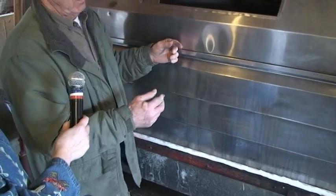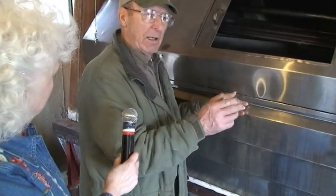And then this part of the evaporator, the way I'm operating today, we swap sides actually every day. Okay. And why is that? It prevents the sugar sand from building up in the finish pan. Sugar sand and nitre, which is basically calcium and some foreign matter that sinks in the bottom as the syrup is separating. And if that builds up, of course, it'll plug up everything. And rather than try to filter it all out through the filter press, if we swap sides of the evaporator, for some reason it kind of helps to push it out. That's where experience comes into play. And the day you get real busy and don't swap the evaporator over from one side to the other is the day you wish you had, because the next day is terrible.